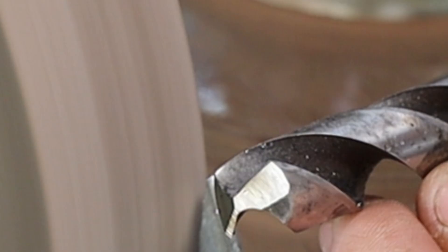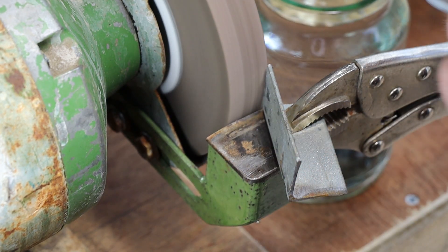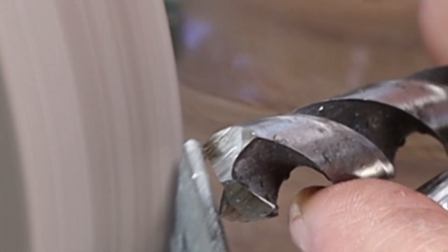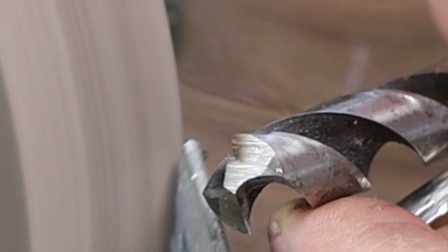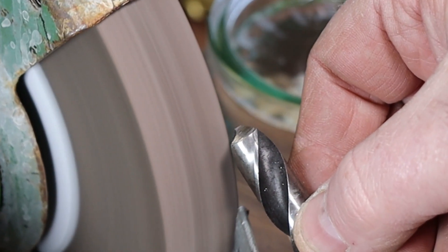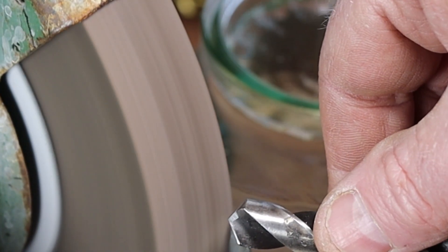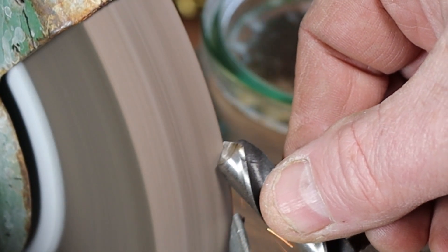On the other side we do have a nice sharp cutting edge. This extra deep relief area is here because the drill bit used to have that sharper point angle. It won't do any harm to leave it, but you can keep grinding the point until it disappears if you prefer. It looks like I didn't cool one side enough and I've overheated the edge a little bit, so I'll need to grind both edges a little more to remove that burnt mark. If your drill bit's bigger than about 10 millimetres or three-eighths of an inch, you'd usually need to grind the web in each flute. This will allow the point of the drill bit to cut through the material, so you don't need to use a pilot drill.